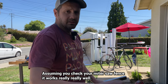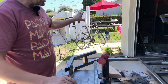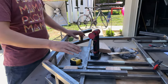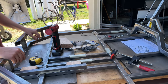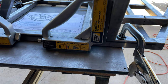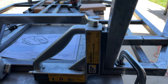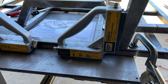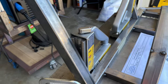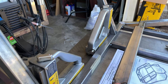So between finding the spacers that help you find dimensions, the angles that help you find angles for your saw, and then angles to weld to, it can really make welding up a spider cart or any project way easier. I got these Stronghand magnets — each one of these, I think at the time I bought it, was like $200 plus. These have been so cool, so beneficial. Downside: stainless steel and aluminum, you're not going to get a lot of use out of them for obvious reasons. You can get really creative in how you position these and get holds that you didn't think were normally possible.